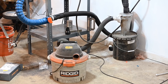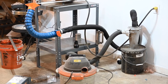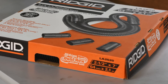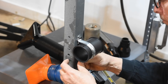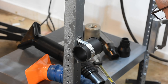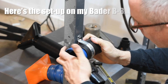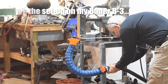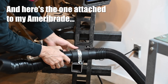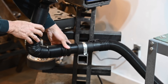For this test, I'm not using any fancy dust collection system, just a good old shop vac. In order to get my two-and-a-half-inch shop vac hose connected to either of these systems, I needed an adapter piece you can buy in a nine-dollar adapter kit from Home Depot. I then used a two-inch conduit bracket — 97 cents at Home Depot — to attach the bracket to something rigid enough to support the hose. Everything else is downstream in the shop vac system, so we're not going to worry about that.